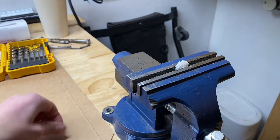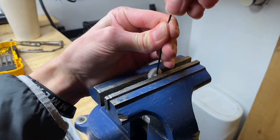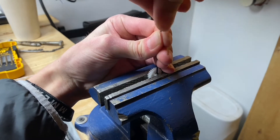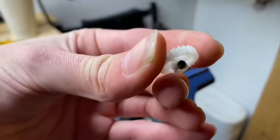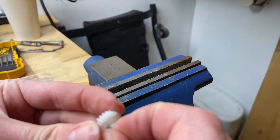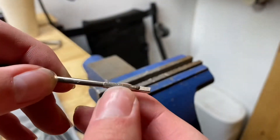I've got this tiny little grub screw right here and hopefully it fits — I had to drill it out a little bit more. Check it out guys, now we've actually got something supporting it. Now I've gotta drill a flat spot onto the shaft there.